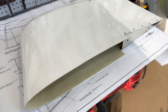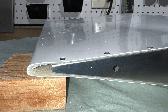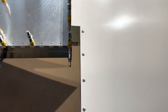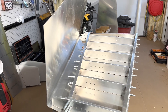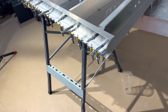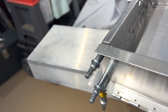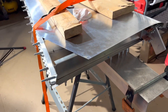I also have the wing tips ready to mount and test fit. This is a stiffener — you can see it's put in there; this will go in the end. This skin will kind of go over here, and then I've got to mount the ruddervator, which is a hinge as well. This is what it looks like opened up — this is half the skin done. I have to bend this over, drill, and cleco-fasten the rest of it. You can get a good look at the hinge mechanism here — all temporarily fastened. There are some mismatches I've got to correct.